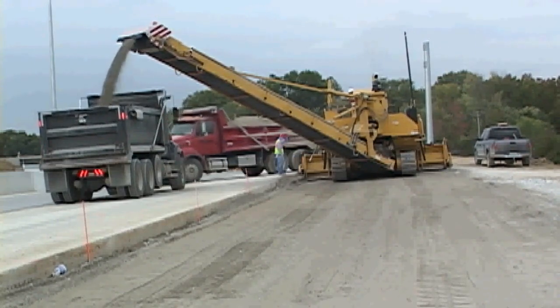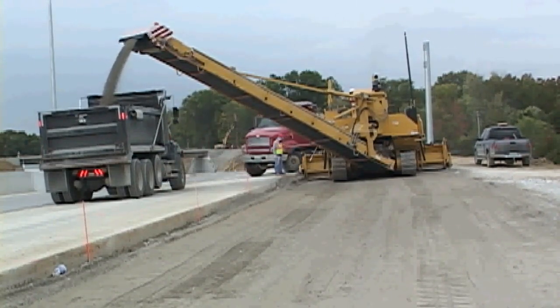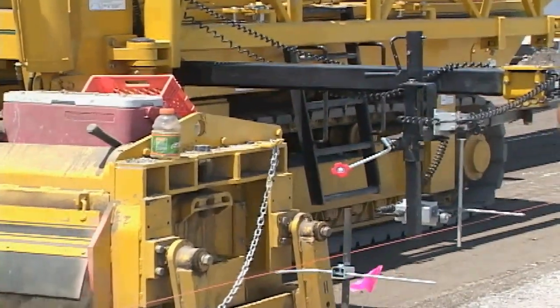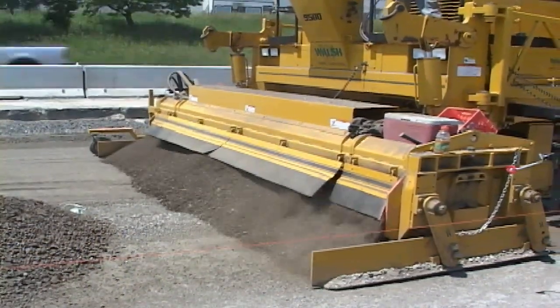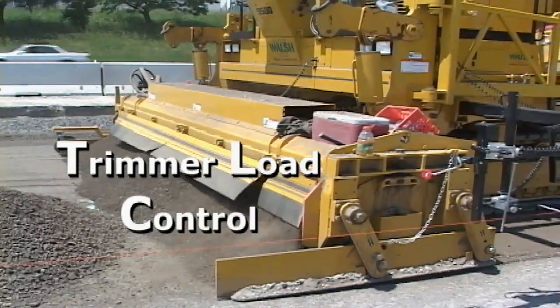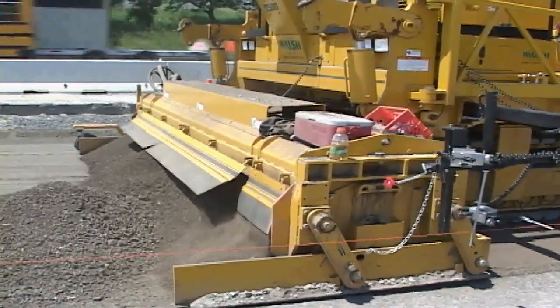The 9500 has a powerful, steady, easily controlled travel speed for trimming and job site mobility. TLC — the Trimmer Load Control feature — is a programmed cruise control for optimum power to the trimmer head. The speed of the 9500 is governed by the trimmer head load through the G Plus controller and activation of TLC.